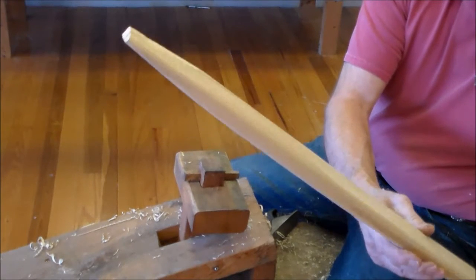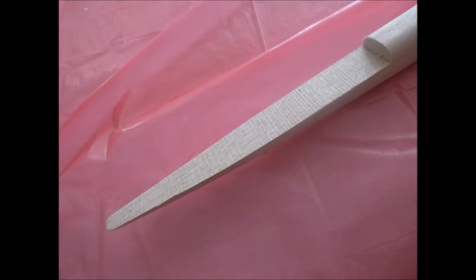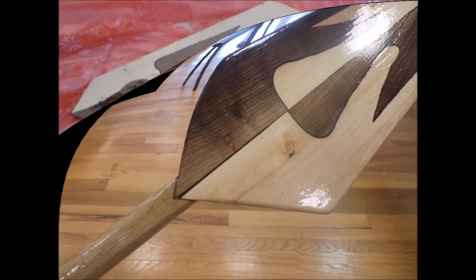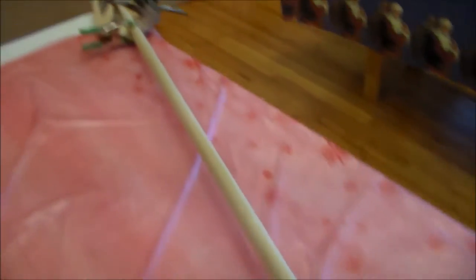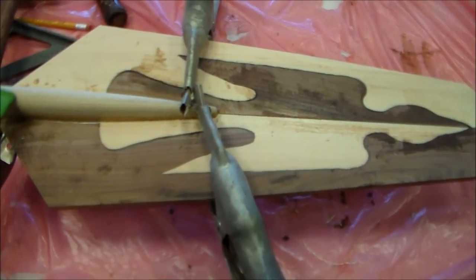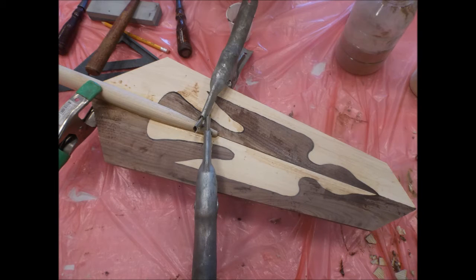Now that excess stock can be removed from the handles. Here you have a picture where I had cut the piece out, and if you look at the upper right hand corner it's squared. What I want to do is chisel that out to make it fit the point of the handle or the paddle. And here you can see the paddle being attached into that corner. After the epoxy adhesive cures overnight, you size the thickness — I ran it through my planer to about a quarter inch in thickness, and here you have the finished pieces ready to be attached. I'm using the same epoxy, this time with sassafras sanding dust as the filler, which gives a lighter adhesive coloring. I'm using spring clamps only to hold it in location with minimal pressure on this joint, so I'm not squeezing out the epoxy.